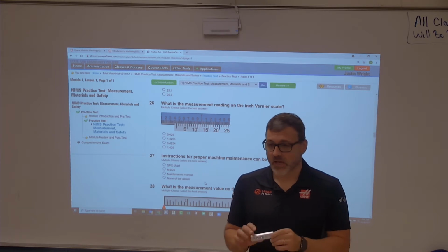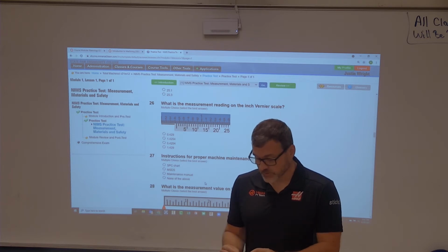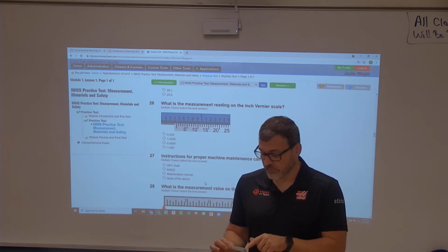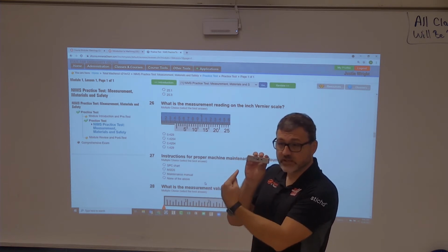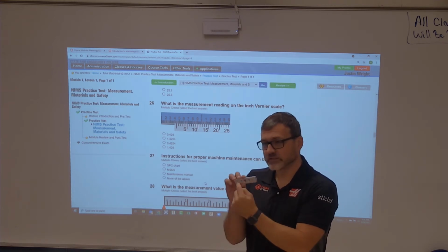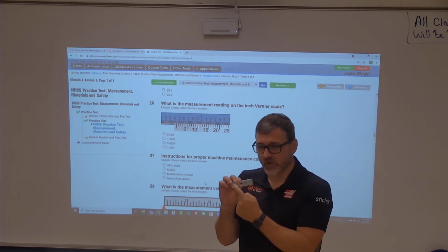Most of the holes in the hole locations look pretty good. If you will take a look at it though, I'm not so concerned about where things are at, but some of the tapped holes are in crooked. So from this view, they're kind of going up this hill, and it's not going in straight. And then this hole that doesn't go all the way through, I think that probably there just wasn't quite clarity on the hole here.